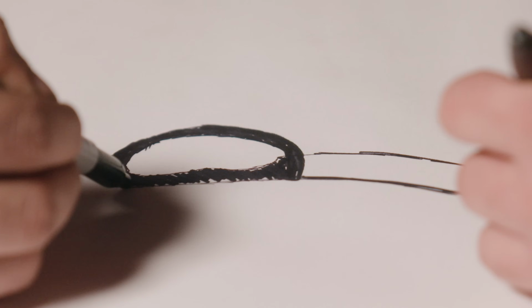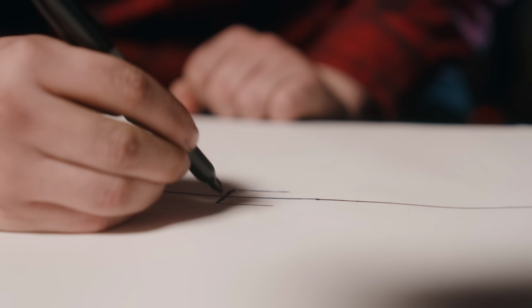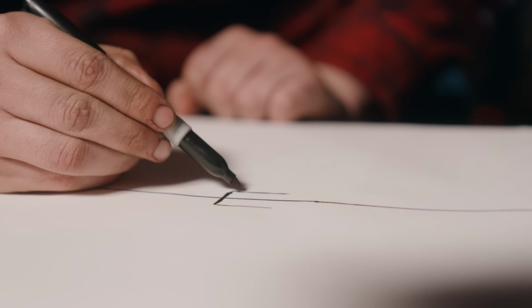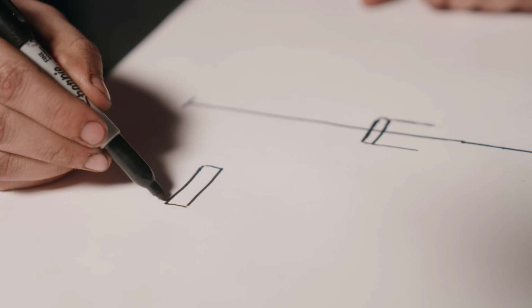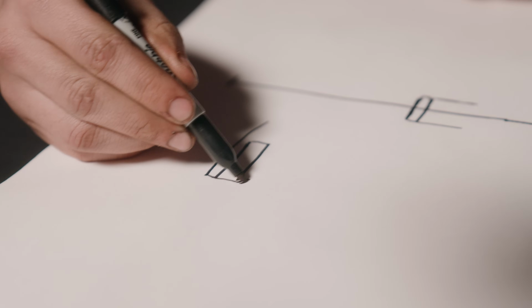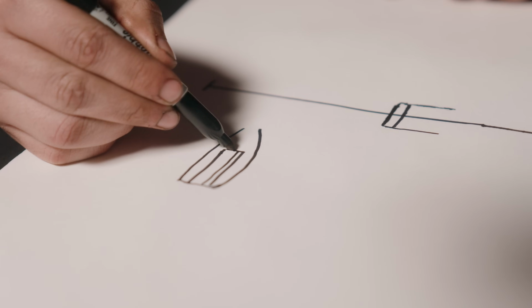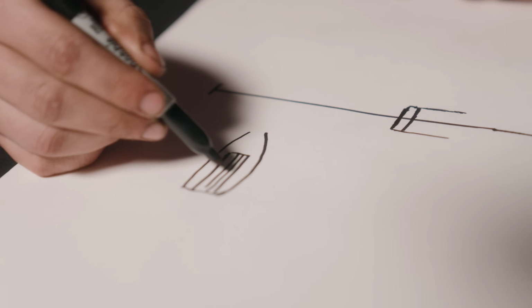Guard? Wrapped around your knuckles. Oh, D-guard. Yeah. Okay. So I'm going to take the guard construction and do a wrap around the blade in a V. And then we're actually just going to take the guard and lap weld it all the way around. And it's just going to be a piece of wrought iron, and this will be our standby. So it'll be a wrought-to-wrought connection. We're going to forge weld it to the back end.